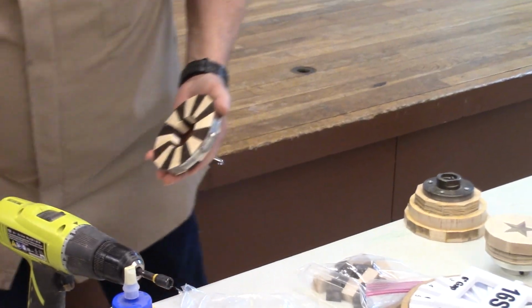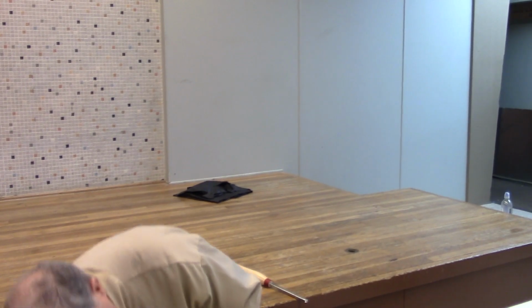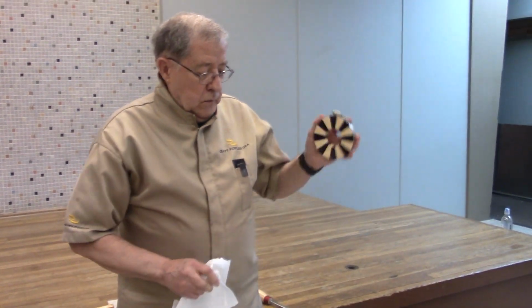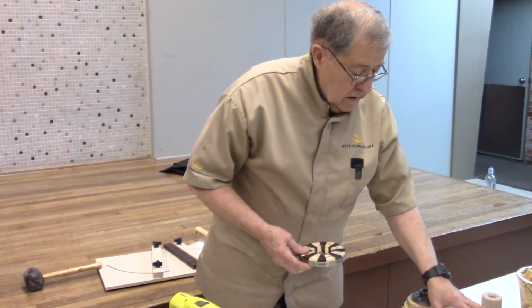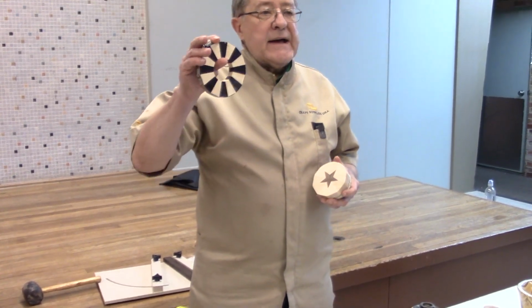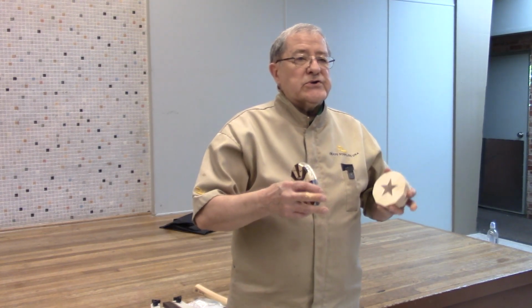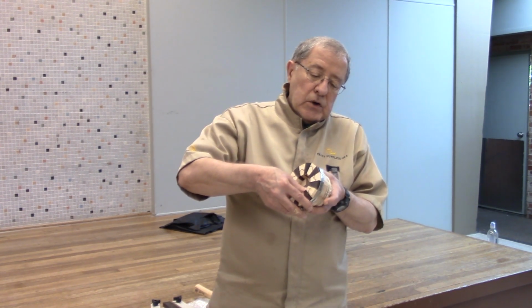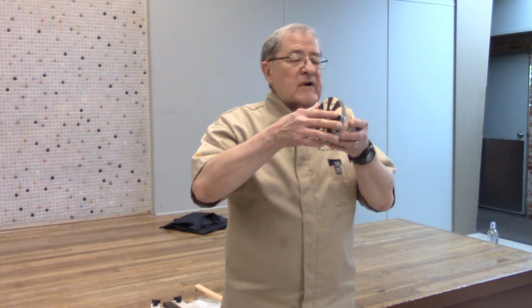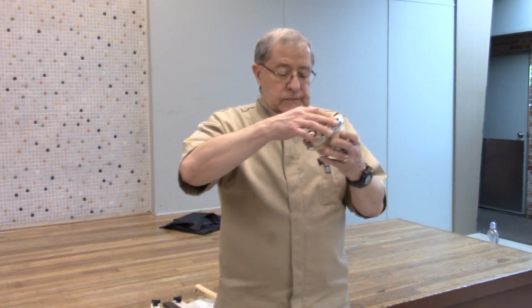And there's the segment. You're done after just one, right? That's all I'm going to show. But this is one of the rings. And then I'll put it on. After this dries, I'll sand it. I'll do all of them and then sand them progressively larger or smaller or whatever I want for the shape. And then I'll line these up and glue them together where they overlap and stick out or in either way. And I can create a bowl,